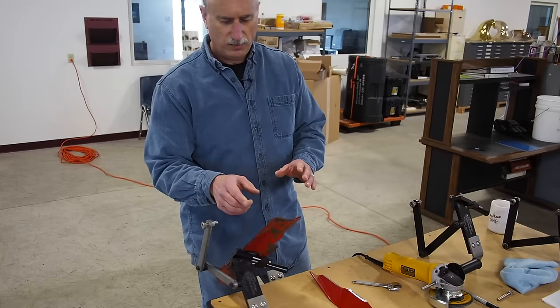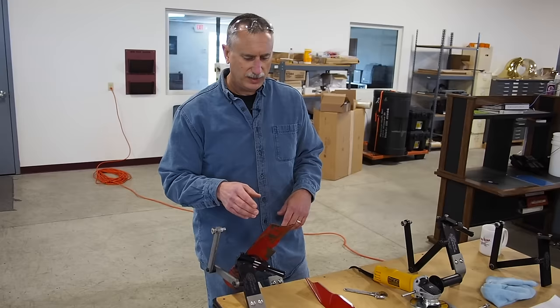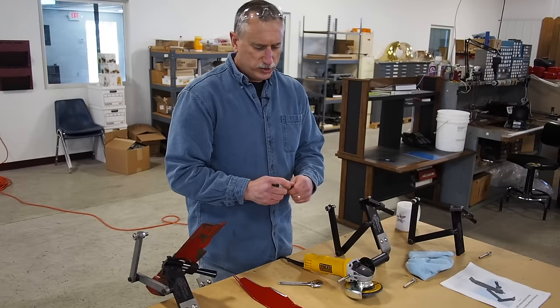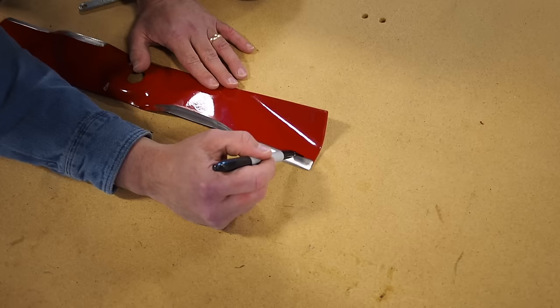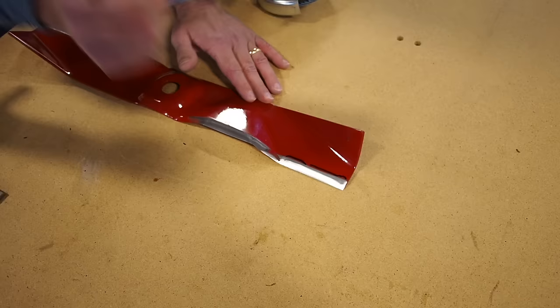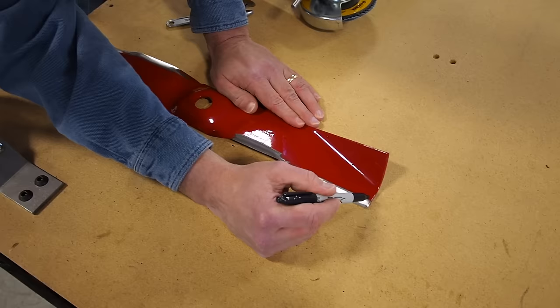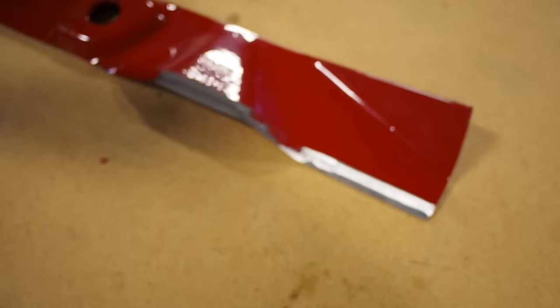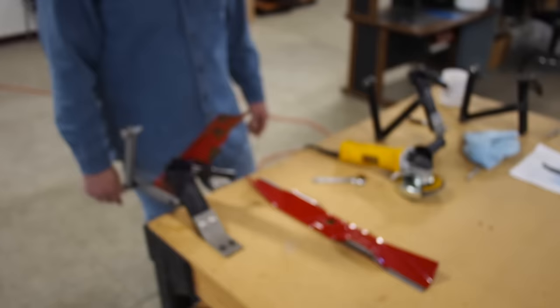One of the other things I wanted to talk about when you're sharpening your blades is that once your cutting edge starts to get chewed up and nicked up, you can't really use that edge as a guide to know if you're making a straight line or not. I'll illustrate this a little bit on this mulching blade. What I do when I grind is I try to maintain this back edge as straight as possible. You can see this one's starting to waver a little bit. So I would try and clean up the bellies or the holes just to get it as straight as I can. As you can see on this end, I did a better job where the whole edge of this is straight. That's how I like to maintain my blades — maintain the straightness of the grind and it gives you a good idea of whether you're being consistent.